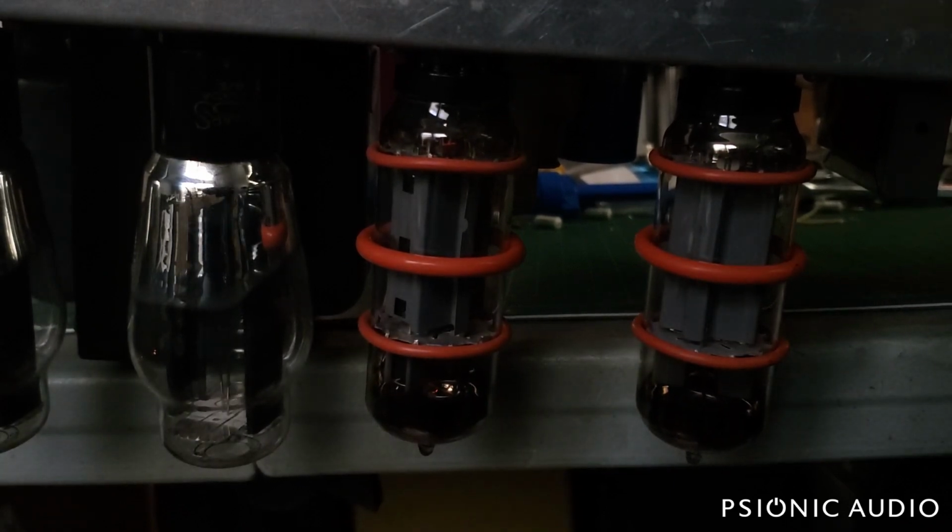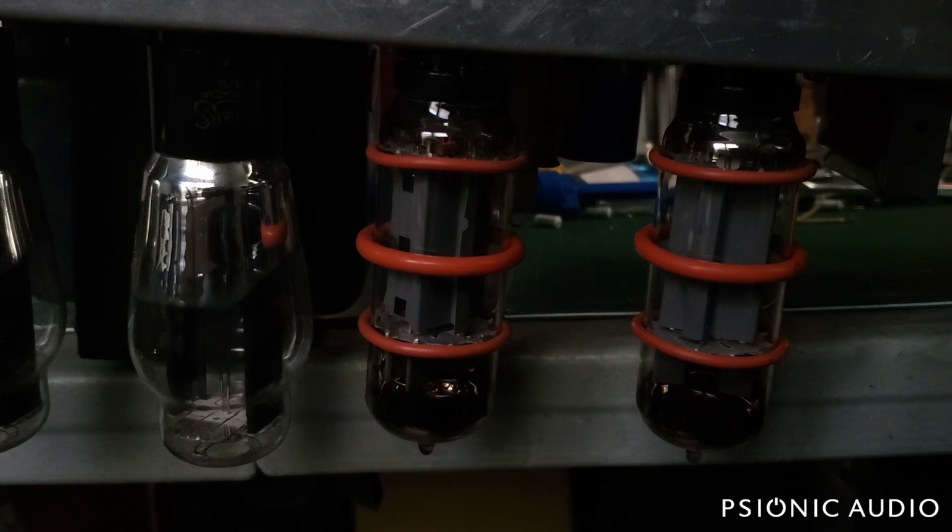All right. It's a very noisy amp. Normally, my goal with any amp I work on is to return it quiet and working really, really well. I have a feeling that this is just beyond my pay grade. I mean, I could make this into a nice sounding, quiet, reliable amp, but it is too far down the path of suck to do all that. So a new pair of 6L6s and a new phase inverter will at least get rid of the microphonics and maybe the reliability issues that might have been blowing that fuse.